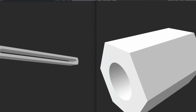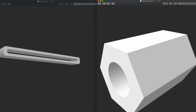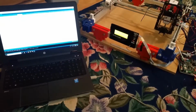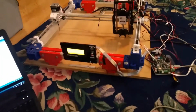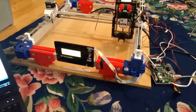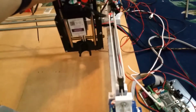Okay, so to actually mount the laser assembly, I designed an M3 slider for flexible positioning, and I grabbed an M3 hex spacer off of Thingiverse. So this is where real progress starts to be made. At this point, we have disassembled the big 3D printer enough to have a separate laser assembly that I've laid down on a MDF bed. We have successfully mounted the laser assembly using an aluminum piece to replace one of the M3 sliders for more firmness.